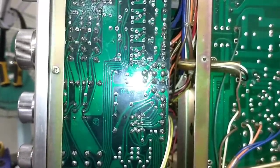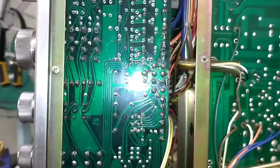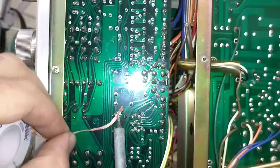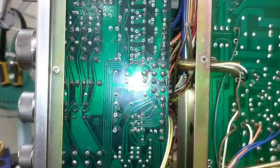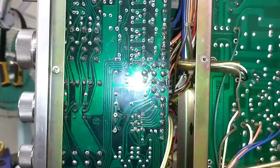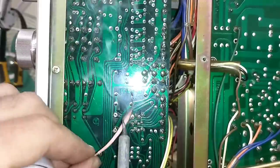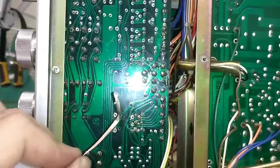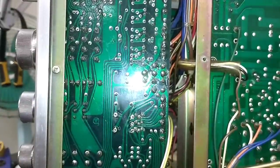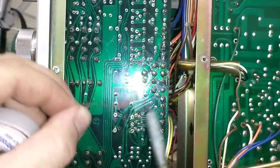One major point I must give you on these boards — the foil traces are very fragile, any of these can tear very easily. You want to use a really hot iron, like a 50 watt iron, and just be as quick as possible. Because if the heat's on the board too long, the glue will let go of the traces and then you'll have more headaches, especially around this tight area. You want to be as quick as possible. I'm dead serious — you will destroy these boards very quickly if you keep the heat on them.